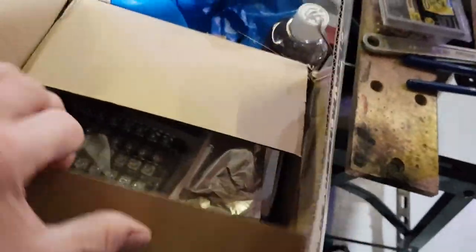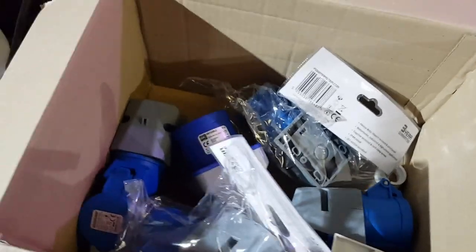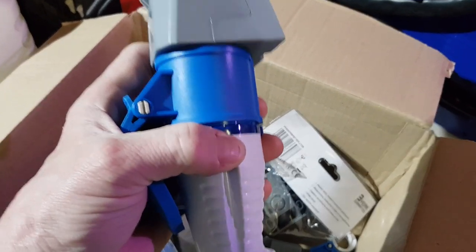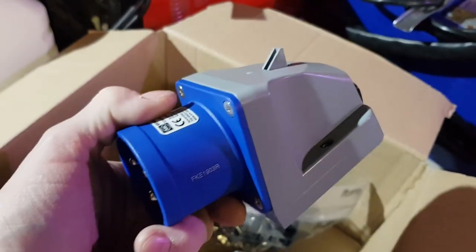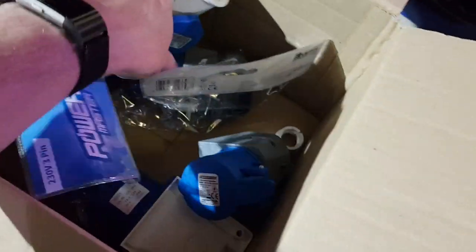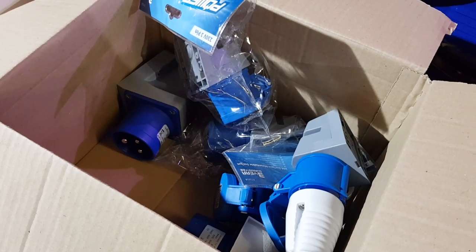These connectors go to the elements and will be on the back of the control panel. This is a 32A inlet for input power, and then these are 16A outlets — so we will have 16A sockets. All of this will be on the back, out of the way, so it's completely modular and everything can be undone and put away. That's the theory, anyway. So soon I'll start building the thing.